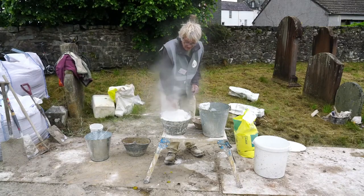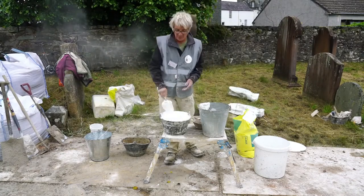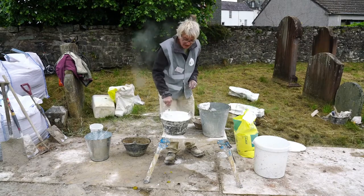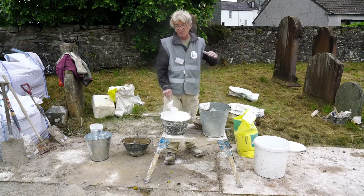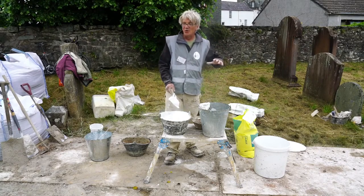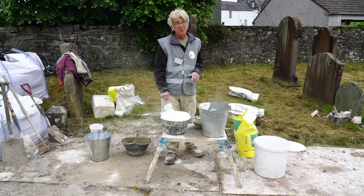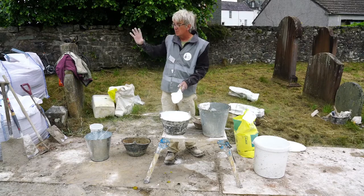If you were grouting and you were clever, and that is 100 degrees, I can tell you that, it's just landed on my finger, and I've got a little internal thermometer in my finger, so that's okay. That's pretty thick, yeah. That's certainly not a water thin coat of lime wash. It's also got good rheology. Sorry to use that word, I didn't know what it meant until recently. I always use the word flow. So it's got good flow, and although that's pretty thick, you could put that on the wall. Because it's hot, you thin that on the wall, and it flows, it spreads, it moves very readily because it's hot.